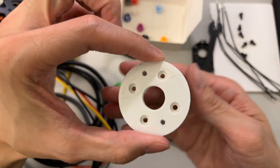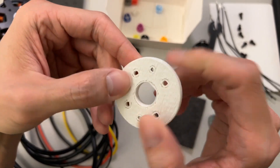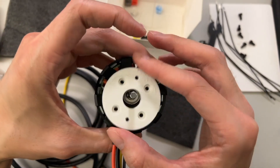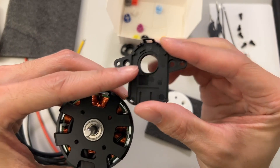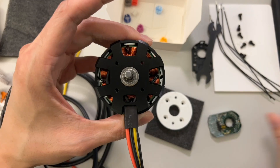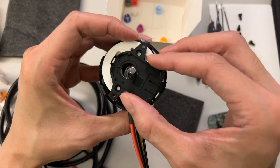I've made a custom 3D-printed part here. You need this piece because the adapter piece's hole locations typically don't line up directly with your motor. So you first place this 3D-printed part onto the motor, and then once it's placed, you can place your adapter on top.